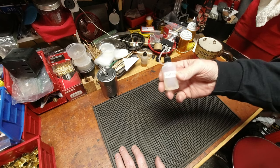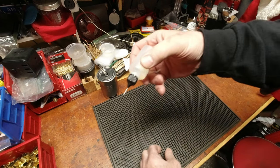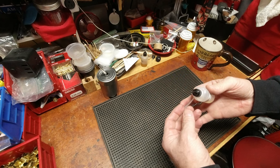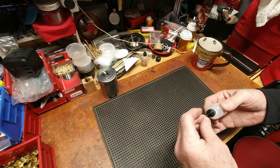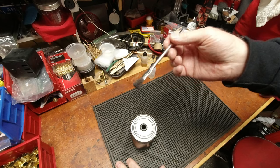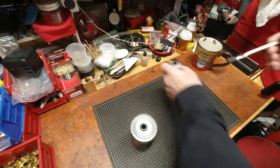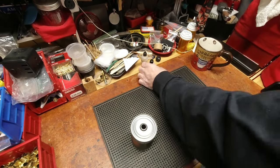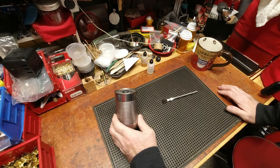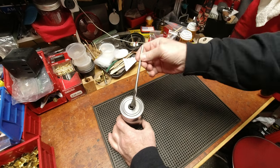This existing oiler isn't ideal because it doesn't have a long arm — I have to get pretty close to the spinning wheel. I also use these acid brushes: I put some cutting oil on and brush it around. I decided to go and make a ghetto version of what Deez had — a spill-proof cutting oil container for my acid brushes.